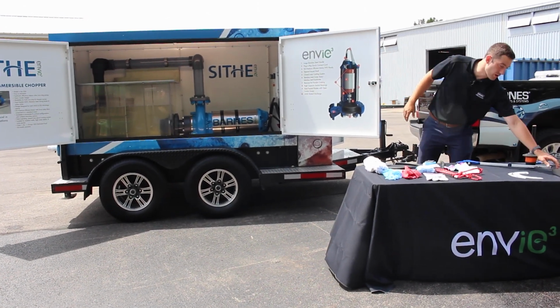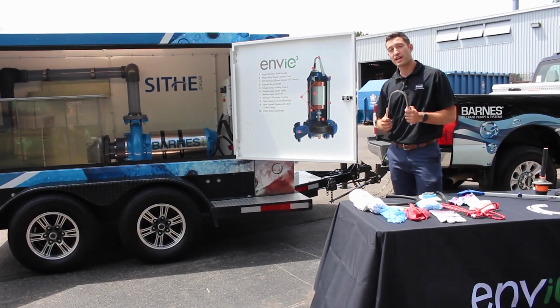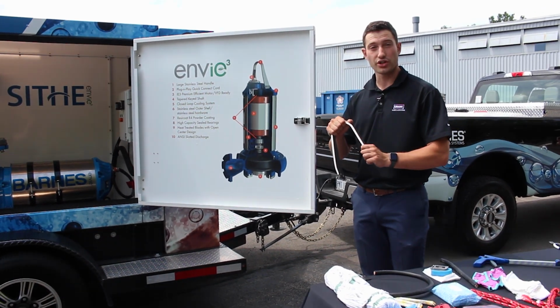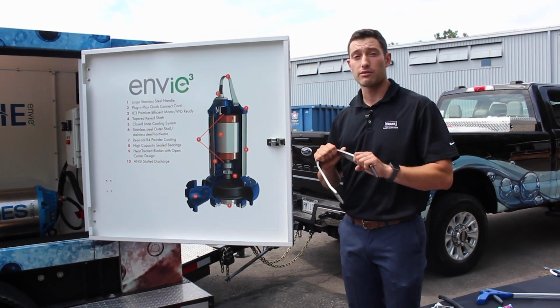Starting at the very top, we have our lifting bail. It's a beefed up lifting bail, making it a lot easier for the end user to get a hold of it. If they have to drop a hook down in there, we want it to be an easy target, something they can easily latch onto and have a secure connection. It's made of 3/16 stainless, that way it's not going to be something that rusts out on you.